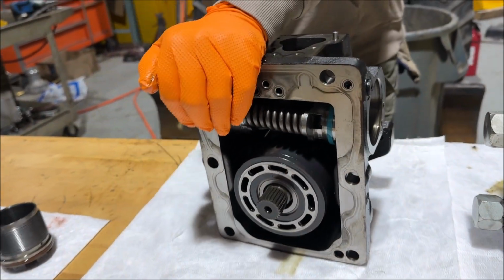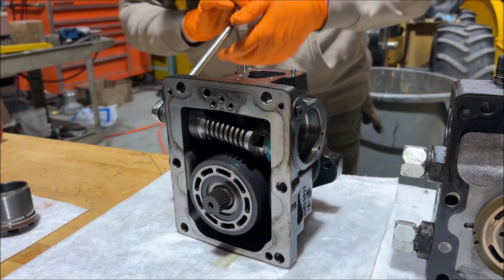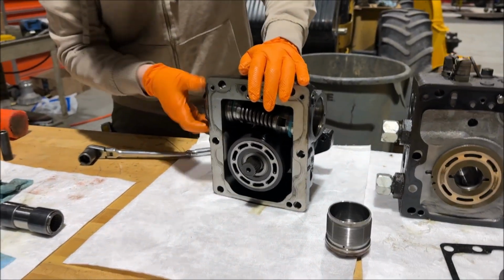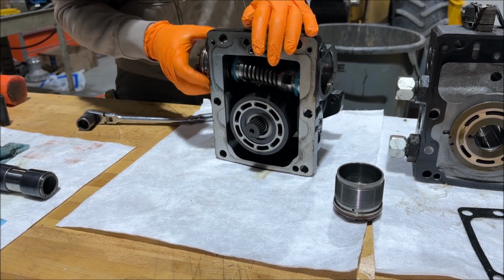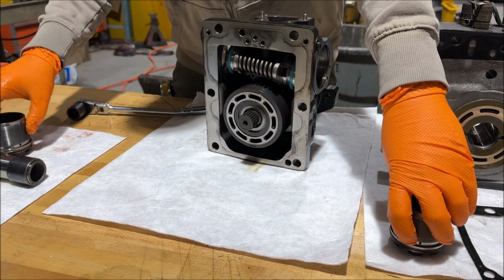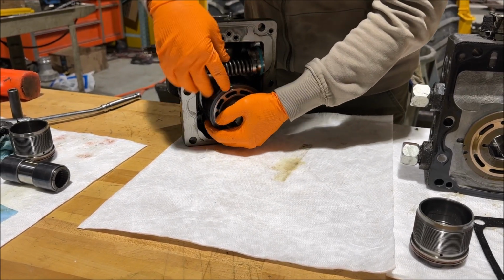There have been some micro trenching blades, not ours, that have had large gullets that are prone to snagging. And a blade that comes to a screeching halt repeatedly can cause this one part to break in these pumps. It got so bad that at one point, our local Ditch Witch service manager said, we're not going to honor the warranty on these anymore if you're using this brand of micro trench blades. Now, that manufacturer of micro trench blades has long since fixed this problem, okay? But you can break a weak part in this pump if you bring a micro trenching blade to a screeching halt.